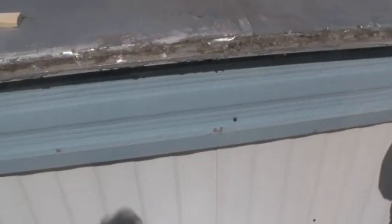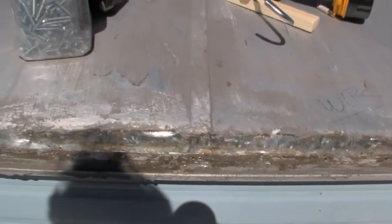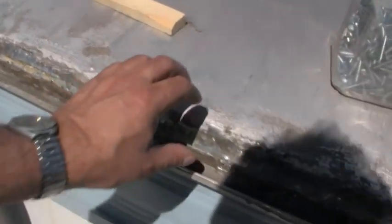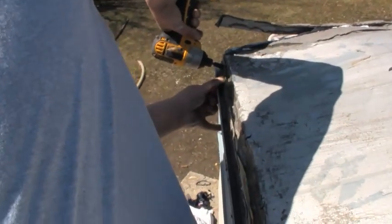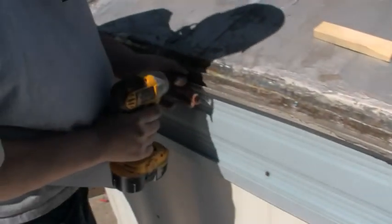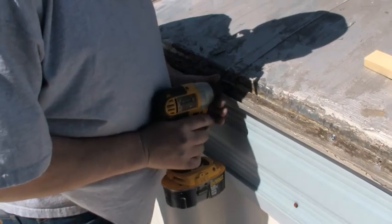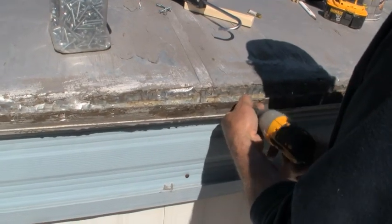And we can take our drip edge, and try and line the holes up. Works best for where they were. Okay, there's your screws there. And try not to miss any. Try and get every screw hole you can. And that'll tighten itself up too, the roof line. Okay. We'll just screw this section on here. Then there's one more step that we normally do.